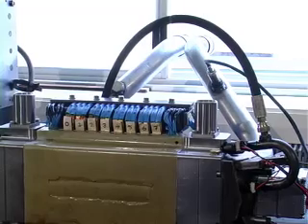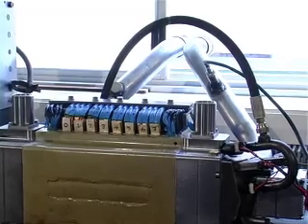Permanent magnets are attached to this mover, and as the permanent magnets fly backwards and forwards by the force of the combustion, they're being forced through a series of coils wrapped around the permanent magnets. As the magnets are forced through the coils, it generates useful electricity.